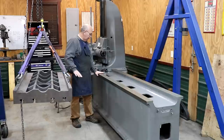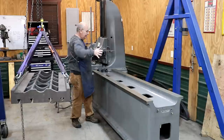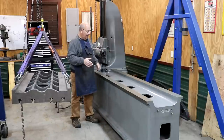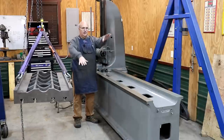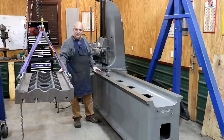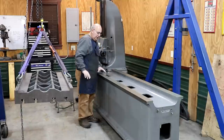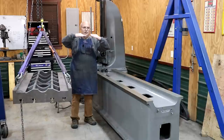I then scraped the top of this over on my surface plate to make sure we had a really good surface — it was crowned almost perfectly. We basically just broke the surface up, checked it, and everything was good. We're going to use this table now as a reference surface — you could think of it as a surface plate. We'll bring it over here and let it bridge across the front way to the back way. My goal is to make sure these ways are flat from end to end and that the plane of the front way is in exact alignment with the back way.